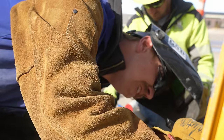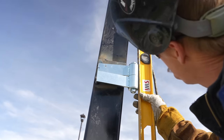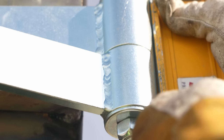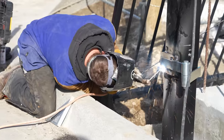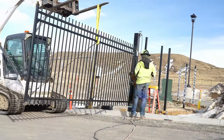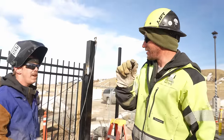We're using the six-foot level as a straight edge so that we can make sure that these two hinges are straight with each other. We've got a little gap right here - we don't want that gap, we want it to be touching the level. Everything's tacked up at this point on this one leaf, not permanently welded, and Alan has set the hinges to match the angle of the slope - actually just a little bit more. We haven't tested it yet.